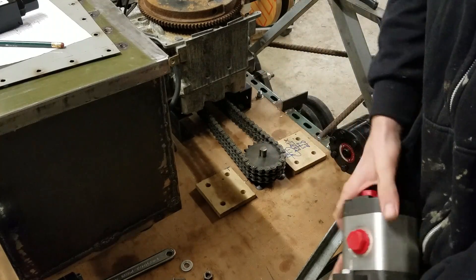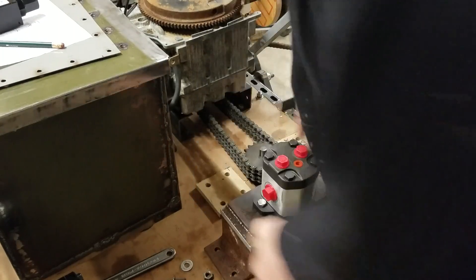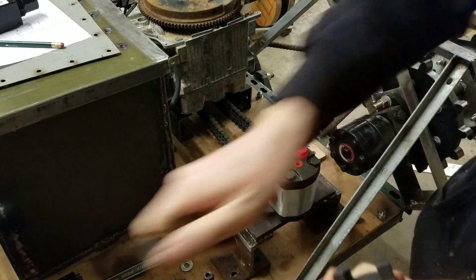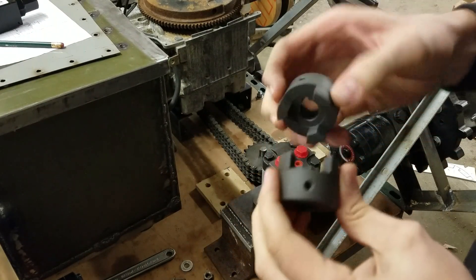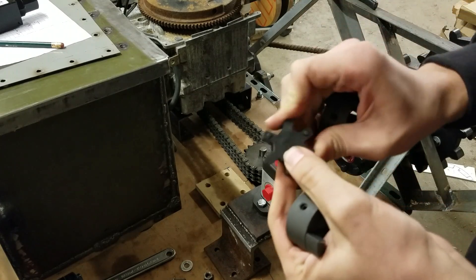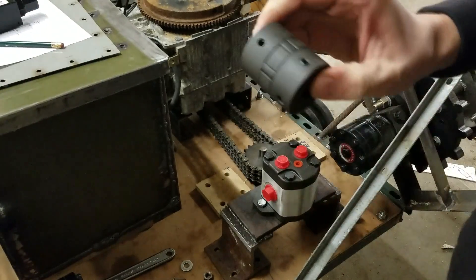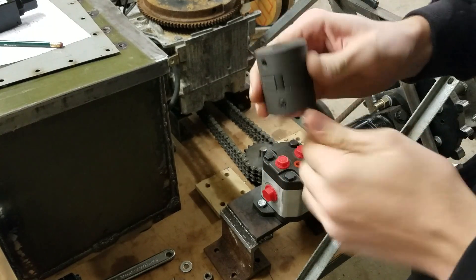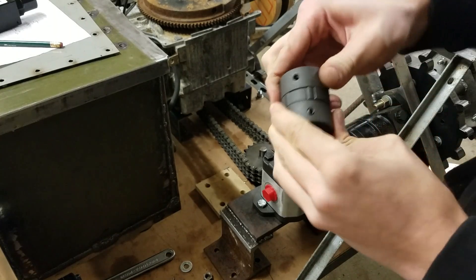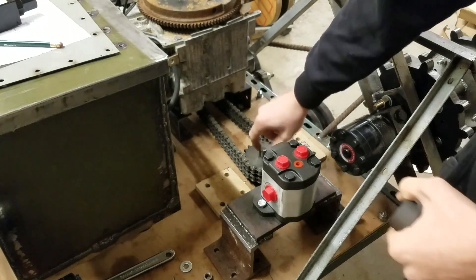You can see in here — that's the shaft of the pump coming out, which is attached to this Lovejoy coupling. The way these work is there are two halves and a rubber spacer on the inside. It's pretty stiff rubber, but you can see me bending it with my fingers. This spacer goes in between the two halves — the two jaws on each side — and that's the coupling unit. The reason you'd use something like this instead of a straight solid piece of metal is because it accounts for any loose tolerances or misalignments you might have.